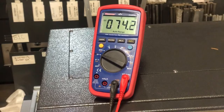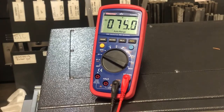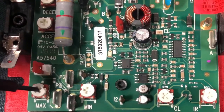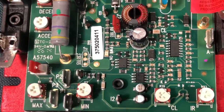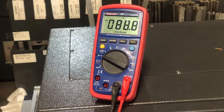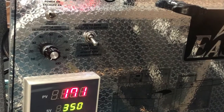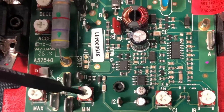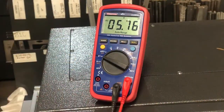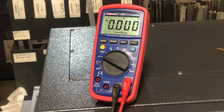For the maximum, all of our motors are 90 volts DC, and you're going to adjust the small trim pot on the DC board up to 89 volts DC, just to give us a small buffer. And then same thing for the minimum, we're going to turn it all the way down to zero on your conveyor speed, and then we're going to adjust the minimum speed pot on the DC board down until you read zero. And that's how you set up a new DC board.